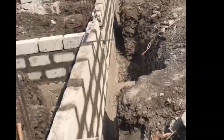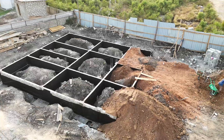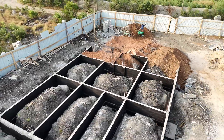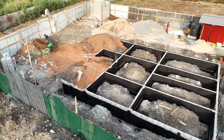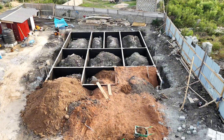After we got our filling to site, we painted the block work internally and externally with bitumen. This protects the foundation from water seepage, which can cause dampness, mold, weakening of foundation walls, and also prevents water ingress. After painting, this is how the foundation looked, and we went straight to filling with grade one filling, which is best for foundation work.